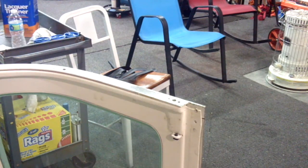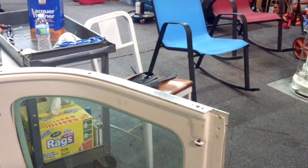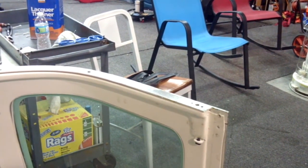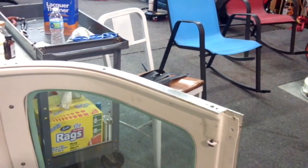You'll notice we're all back to being clean again. About a third of the way through putting the contact sealer on, I realized it was running and moving around — that tells me I forgot to clean with lacquer thinner to get all the xylene off of the metal. So now we're down to bare metal and I'm going to start laying out contact sealer again. Be sure you take that xylene off — it eats into the contact cement. It doesn't do any good to try to apply contact cement right over it. That's a little tip — don't ask.